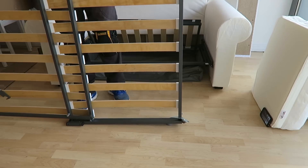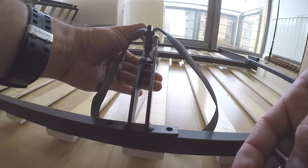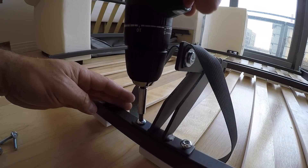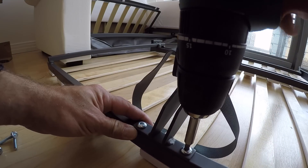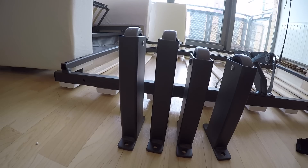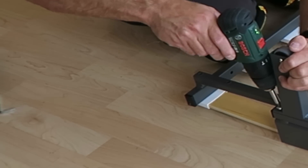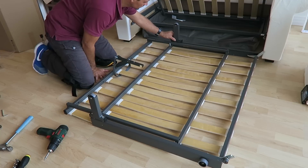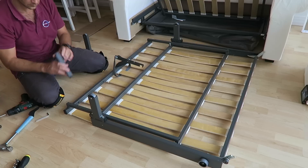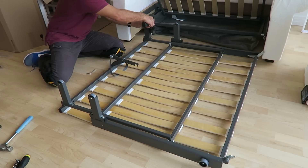This is the second part — two parts joined together. We put it upside down for now. This is the opening mechanism; it's gonna be at the back of the extension, secured with two screws. Bear in mind this is the bottom — we're gonna have four legs, two shorter and two longer. The shorter ones go in the middle and are secured with two screws, one on each side. Exactly the same on the other middle position. And the front gets the longer legs, one on each side, secured the same way with two screws.